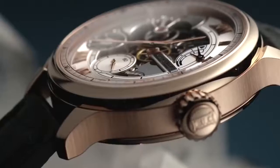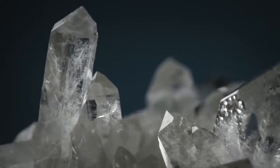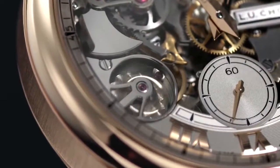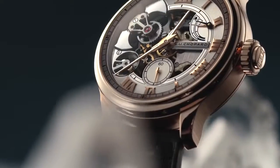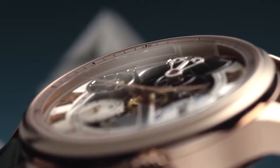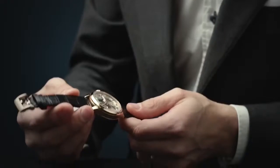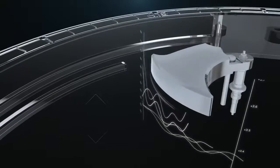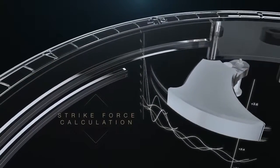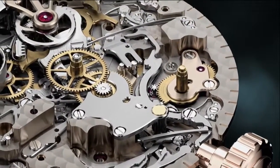In order to best amplify the notes, we decided to use the watch's crystal itself as an acoustic amplifier. The molecular properties of the sapphire confer an extremely pure and crystalline sound to the chimes. To ensure that the vibrations be transmitted as directly as possible from the gongs to the crystal, we came up with a unique solution: coupling them using a built-in component — the idea of a monoblock crystal was born. An extraordinary amount of calculation was invested in the dimensioning of the energy delivered by the hammers when they strike the gongs, so as to attain from the crystal a sound that is both strong and clear. This is the Full Strike by Chopard.